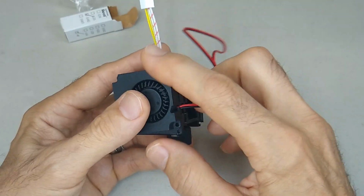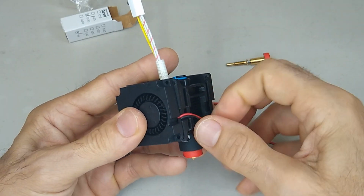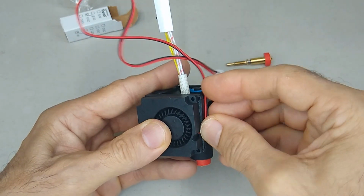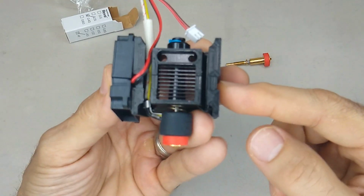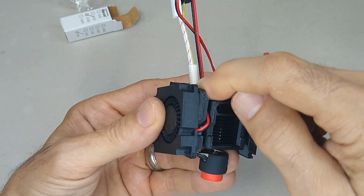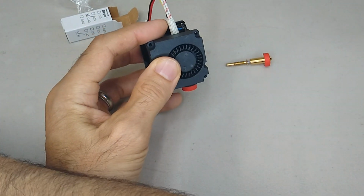And now I have these grooves. So what you can do now is install your fan on the groove and then just push the wire into these channels to get them out of the way. This first one will go in the channel and come out and up through here. The fan from the other side goes on this side, follows the channel, goes behind, and again makes its way up through here and then comes up and out. In addition to that, I had to redesign some ducts.